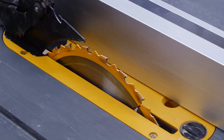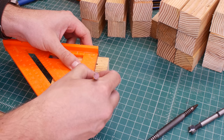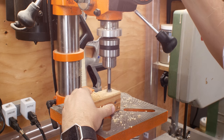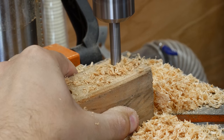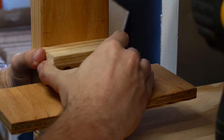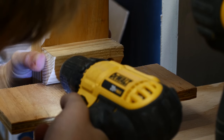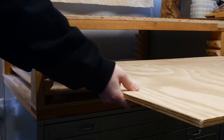Off camera I cut down two half-inch sheets of plywood into shelves. To make the rails to hold the shelving, I cut down a scrap 2x4 on the table saw. I wanted the rails to have an angle, but also needed it to be easy to screw into the frame, so I marked where the two screw holes would be and drilled half-inch holes into each rail using a Forstner bit on the drill press, making sure not to drill all the way through. I drilled the holes before cutting the angle, since drilling through an angled surface would be much harder. With all the holes drilled, I set the table saw to 45 degrees and cut the rails, then cleaned up the edges on the belt sander. I drilled pilot holes and screwed the rails into place using a scrap piece of plywood as a spacer — a long, painful process that could have gone more smoothly with better planning.